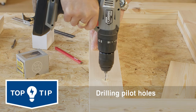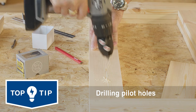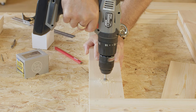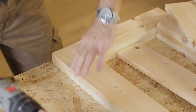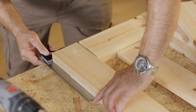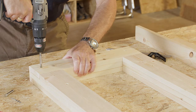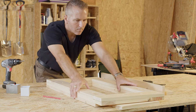Beginning with the front of the drop-down leg facing the workbench, drill your pilot holes without going all the way through the timber. Each pilot hole must be countersunk, as the screw head will need to sit below the surface. As you're drilling your pilot holes, use your combination square to ensure that your lengths are sitting at a right angle and flush with the length below. Once your pilot holes have been drilled, you can screw the timber planks into place to form the drop-down leg.